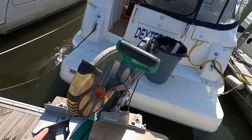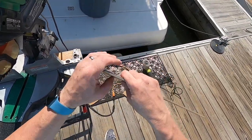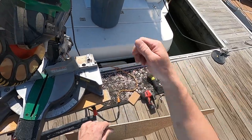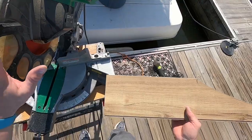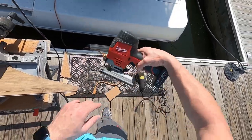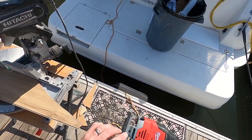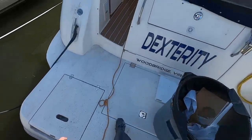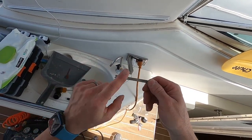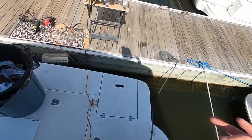Here we are at the boat — it's day three. These are the three tools you need to cut this laminate. Remember, this laminate is thick because I got the performance grade. If you get the regular new core vinyl you can snap and score it, use a razor blade — it's easier to work. But with the performance stuff you need a saw and a couple other tools. The one tool I just purchased is a little M12 Milwaukee cordless circular saw — I'm on the boat so I don't want another cord. And you need a laminate blade.